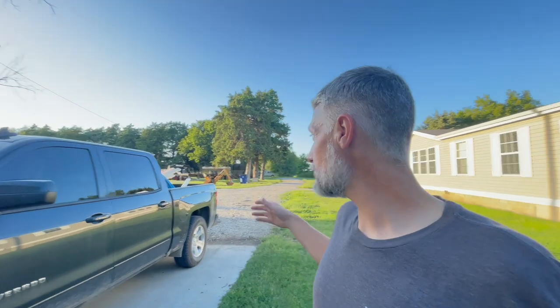I have a lot of rock in my property out here, and that's the reason why I'm using a backhoe instead of a trencher, because a trencher just doesn't tend to work out. We used a trencher when we ran power to this shop right here and it was quite the ordeal. So I'm going to use the backhoe. It's going to make the trench quite a bit wider than what I need it to be — that's just what you got to do when you have giant rocks all through your ground. So let's go get started on the trenching.